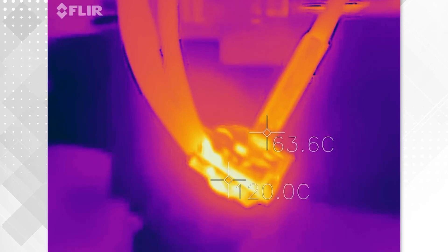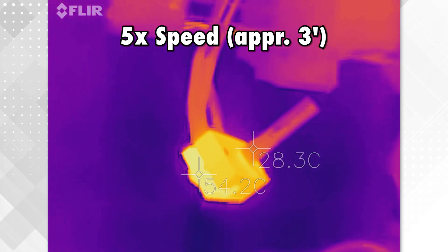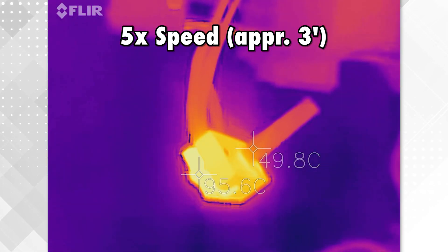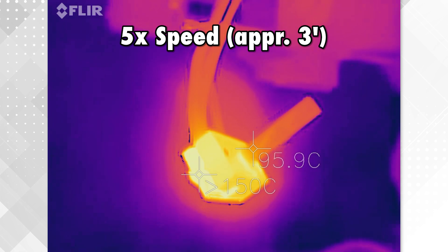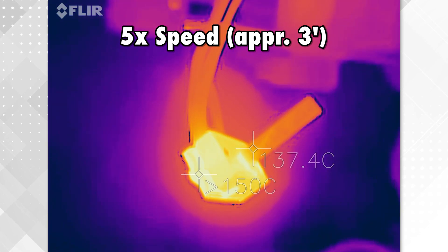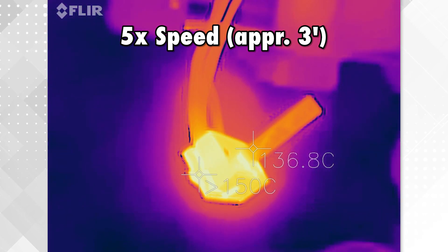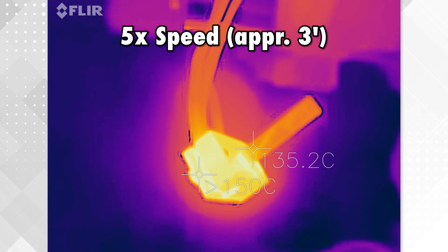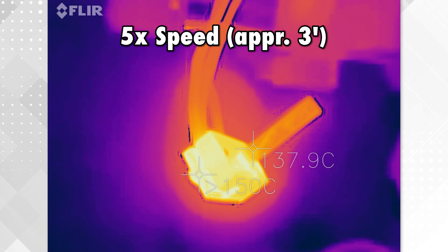You see here a close-up — it's again around 65 degrees. This is the hotend of the clone machine. As you will see later on, it's a pretty simple design. Here is the same exact experiment: I have set the set point to 200 degrees, and you see that basically having no heat separation, the heat pipe — I can't even call it a heat break — is increasing in temperature. In this case I don't have any PTFE tube inside. It gets up to 135-136 degrees, which is much higher than the Prusa original.